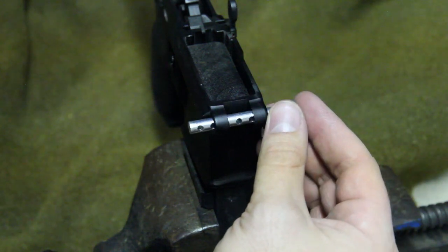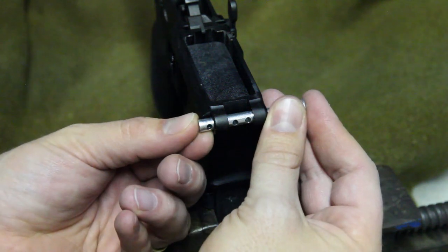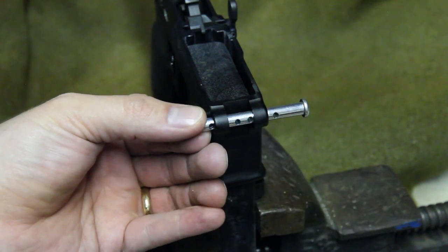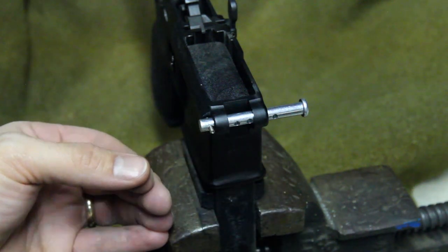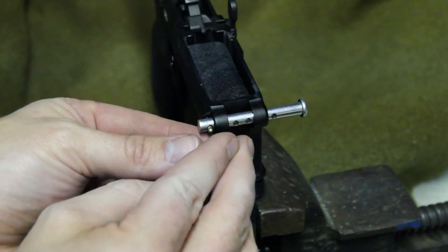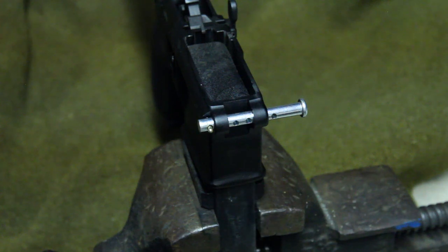What I'm going to do is line up this last hole with the recess in there for the spring. Take the spring, put the spring in, then follow it with the detent — set the detent in. This is where it's nice and convenient to use this method instead of the typical approach of pushing it in with a punch and hoping you don't lose it.